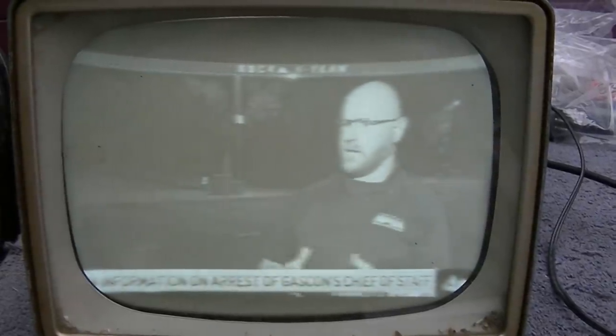Here's what it looks like now. It really needs the rest of the vertical capacitors changed because it's sort of unstable, not real bright. I think these things were maybe intended to be used in bed or next to your bed, because I've seen two or three of these now with good-testing CRTs and they're just dim. It does not have a sharp, bright black-and-white picture — it actually sucks. This gets an F-minus on performance.